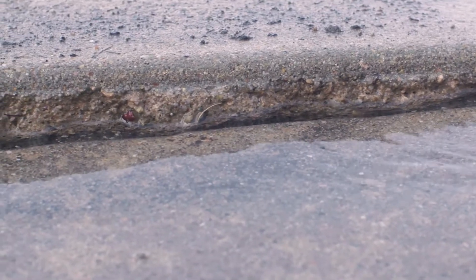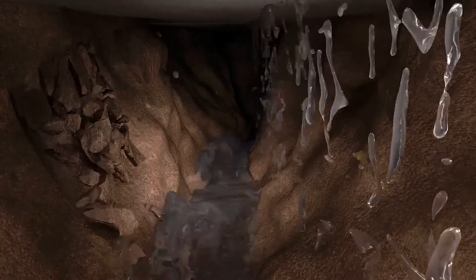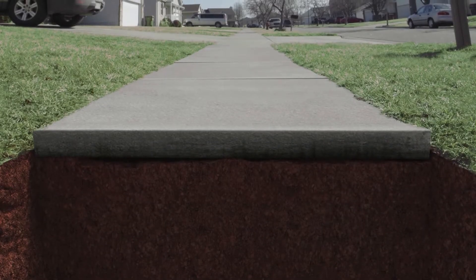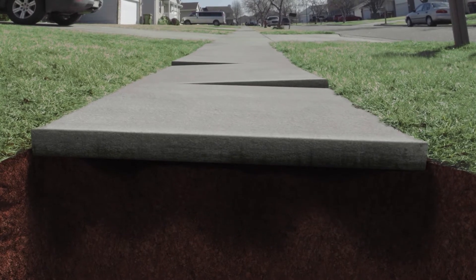The point is you have lots of cracks in your concrete which are all entry points for water. And water that travels underneath your concrete will carry away small amounts of soil. And that is bad because those soils are what the concrete is resting on. This happens slowly at first, but the more soil is removed, the more water will flow, which will remove more soil faster and faster.